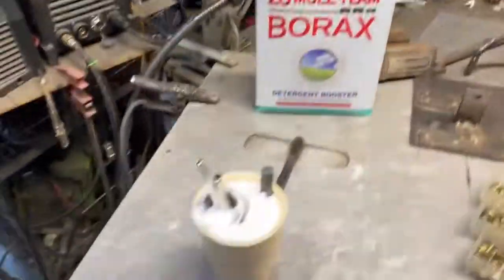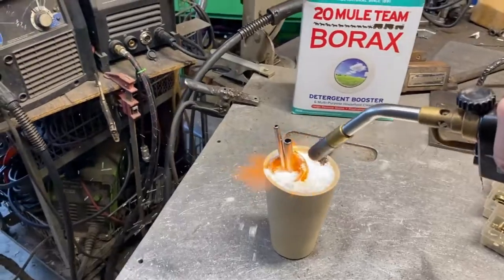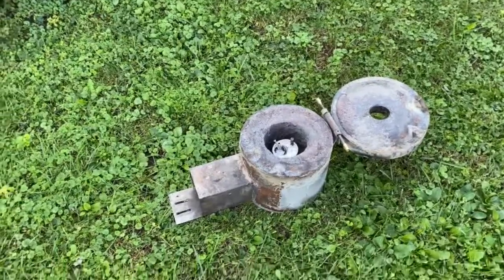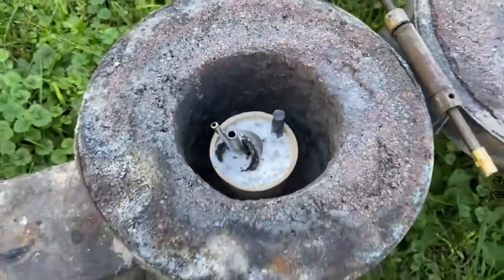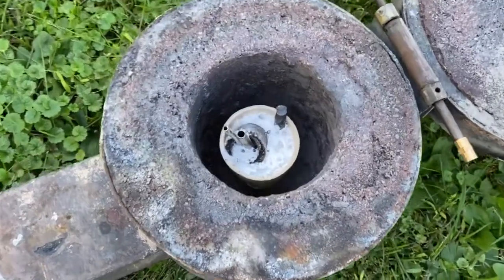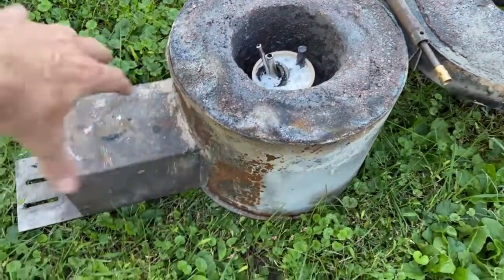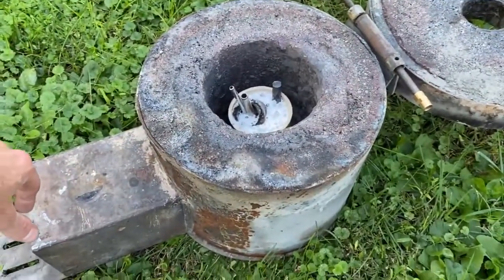This is not anhydrous borax. I've got to give it a little bit of a melt so it doesn't just blow away in the high velocity flame of the foundry furnace burner. These are some of the most forgiving crucibles I've ever seen and as a result we have an opportunity to use something called direct flame impingement. We're not doing the traditional cyclone in this little thing — it's just not worth it. It's a waste of time putting that tangent connector in. When they're this small I've found that it just doesn't matter.